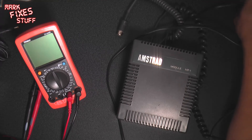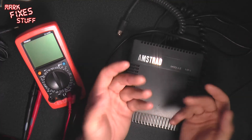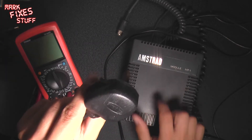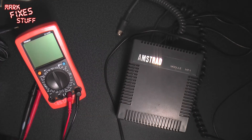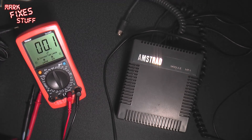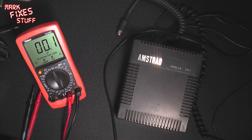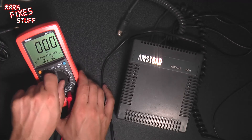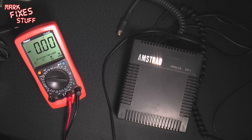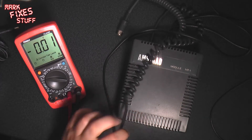So let me just show you what we're dealing with here. What I always do whenever I'm doing some sort of power supply replacement is always check the voltages - always - to make sure that what I think is correct is actually correct, because you don't want to blow up your stuff. So I'll take the power plug for the module MP1 and plug it into the power strip, and pop the meter on. I know this is around 5 volts so we're going to put this into the 20 volt range.